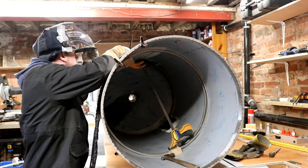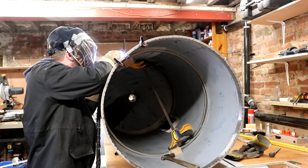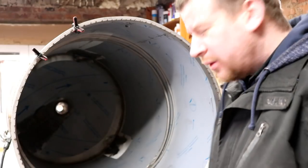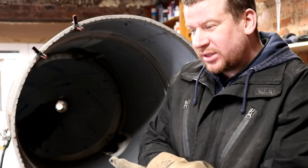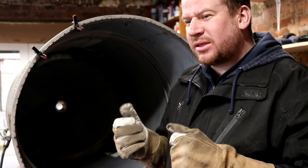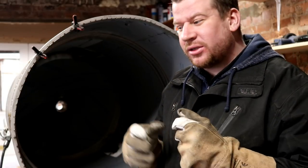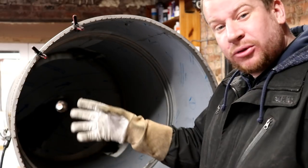We'll give it another whirl but I think we can do this. That second attempt on the other side is better - there's less coking and I've got a longer run. I've tried three different settings on the TIG welder: pulse at one pulse per second with 35% background, and then at 33 pulses per second where I had to bump it up to 70-plus amps. It looked doable but the puddle wasn't flowing as nicely as I wanted. So I may revert back to just having full control with the foot pedal at 60 amps full pedal, and I don't need to back off with quite as much copper sheet as before.